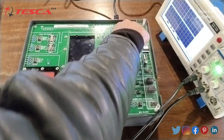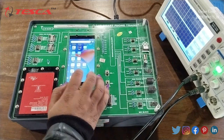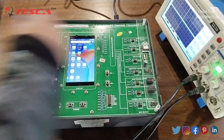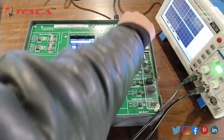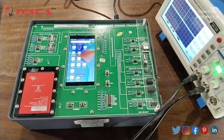Now for the power supply block — if I block pin 1, the positive plus 5 volt supply of the charger gets disconnected and battery charging will stop. You can see battery charging has stopped. If I block pin 2, the ground gets disconnected.